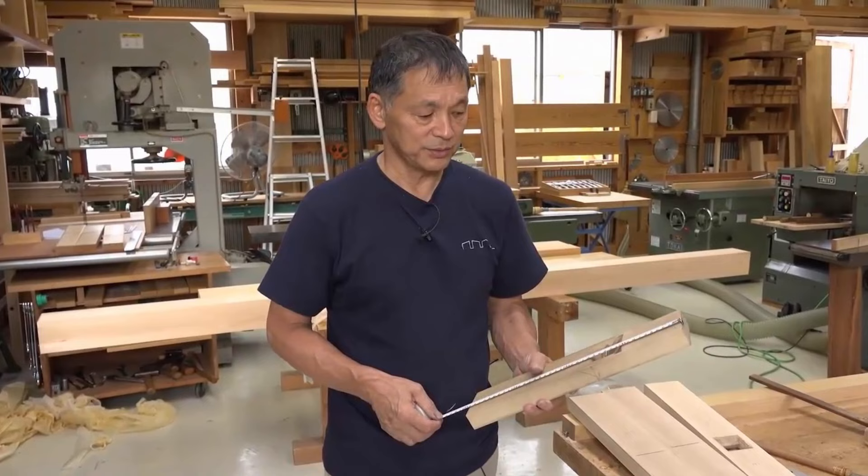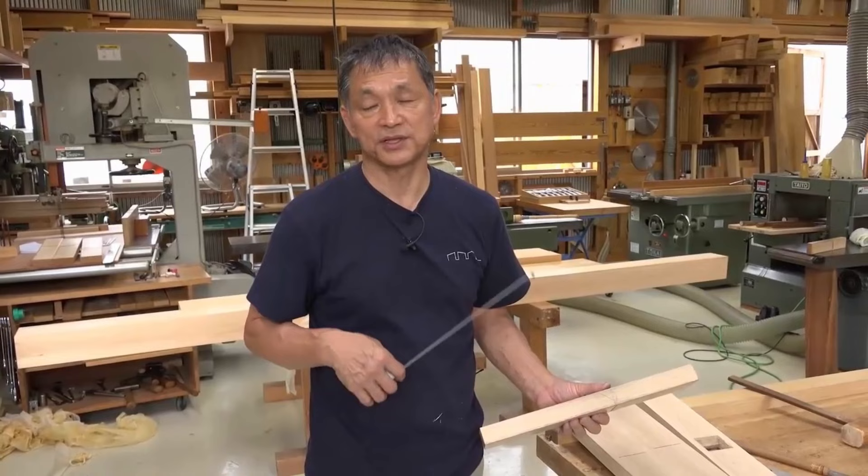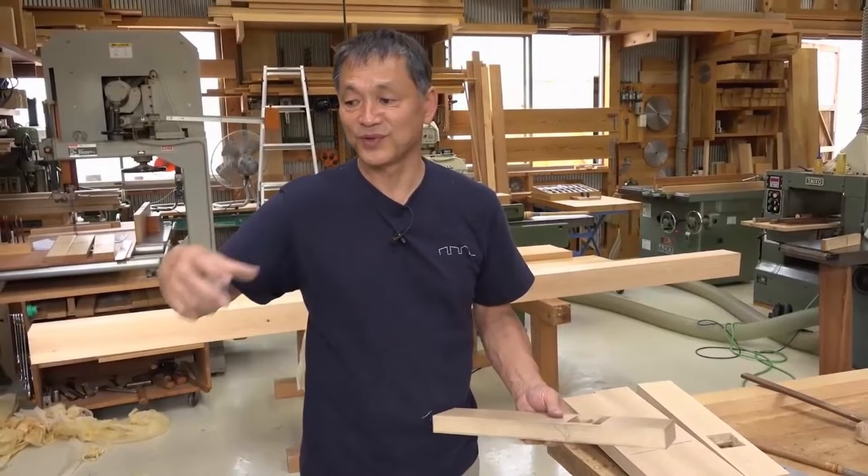In my case, whether I'm making tables or other items, I want them well made and accurate, so I make the bodies 9 cm longer than standard. This way, my plane is very stable in use. Because my plane is closer to the length of a nagadai kana — a long smoothing plane — everyone asks if it's difficult to handle, or says it must be tricky to condition the sole. But this isn't the case, and once you become used to the length, it's hard to use anything else. When a plane is short, it's impossible to get a flat surface because it follows the surface contours too closely.